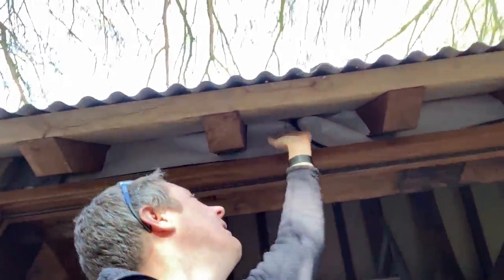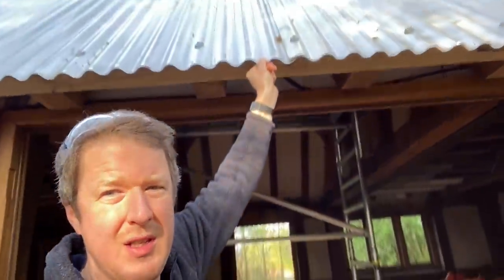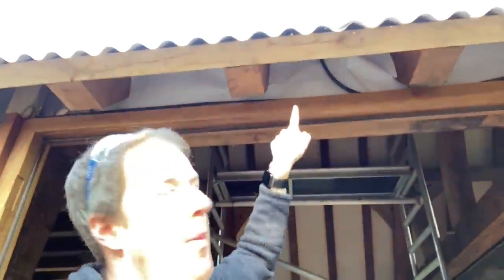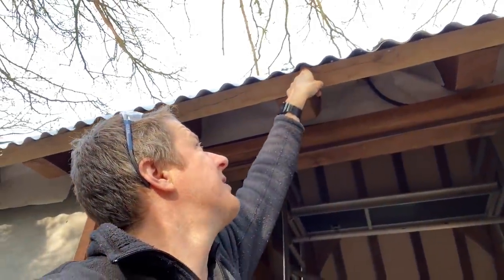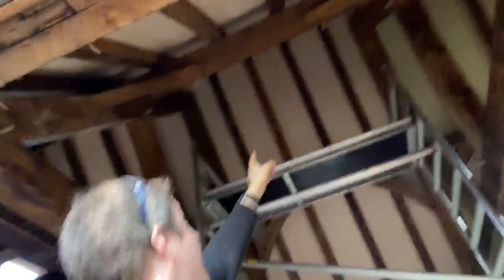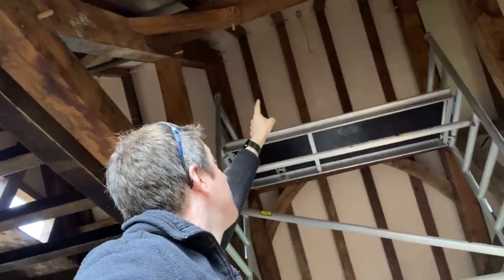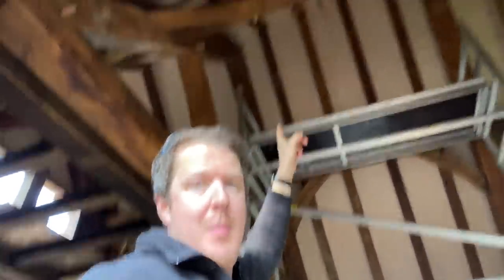What I had to do is drill a hole up there, drill another hole up here. There's basically this ply boarding, then there's insulation on top of it, and then there's these metal roof sheets. So what I actually did is drilled up at an angle through the insulation, and then I managed to feed the armored cable up over the insulation all the way up using my cable rods, and then fish it out at the other end with the little magnet and the little beads, which are always really handy.